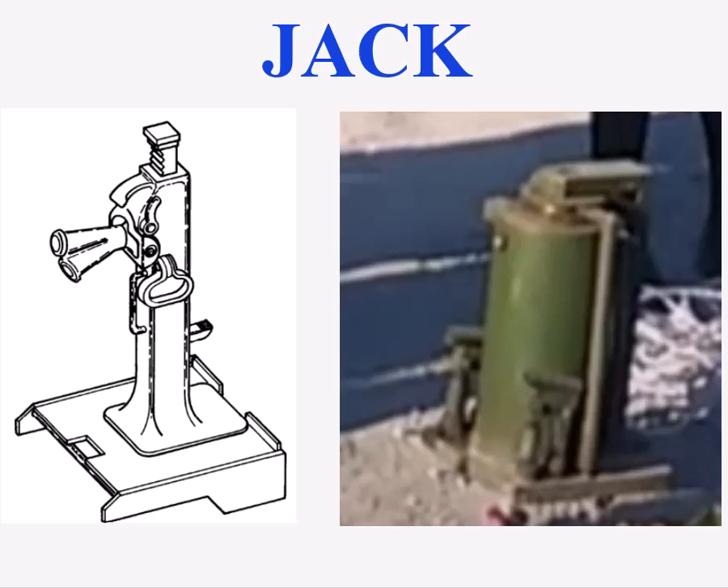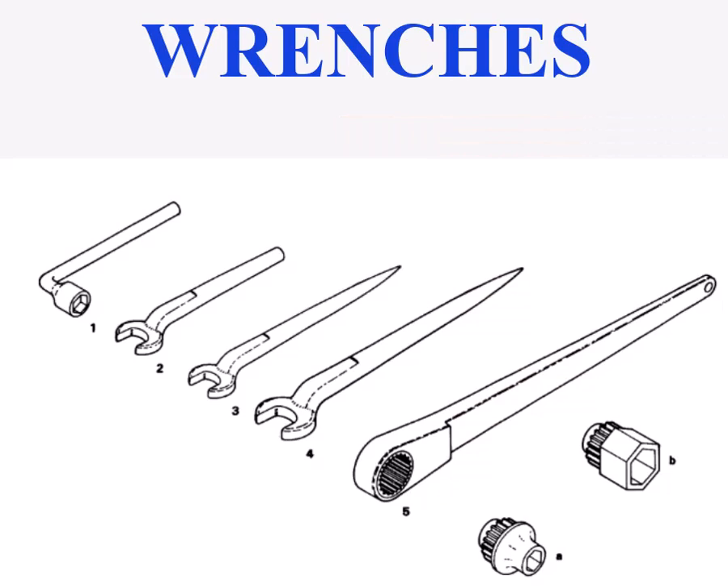The jack is used to lift the bridge on and off the rocking rollers. It is a mechanical lifting jack with a lifting range of 15 inches and a capacity of 15 tons on top. When the weight is carried on its toe, its capacity is only 7.5 tons. Where jacks are lifting at the same point, all jacks used must have the same tooth pitch so they can be operated in unison. The jack weighs 128 pounds. The wrenches are used for tightening the clamps; the wrenches needed for launching the bridge are as shown.